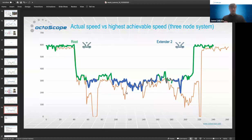We would consider, if those are things that you want to test, then these would be attributes of the device under test. The mesh that we saw there could quite possibly be using 802.11s or Easy Mesh in the background. We don't really know. We didn't look at that particular thing. But essentially, what the Octoscope system is, we can create an environment for you to take any Wi-Fi product into, and then we can characterize the performance of that product while giving a rich set of KPIs and traces and things of that sort while performing those tests.